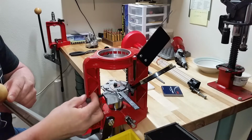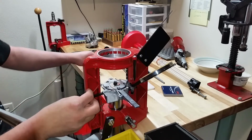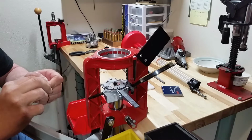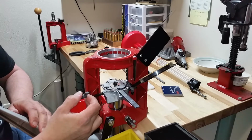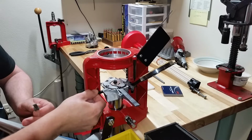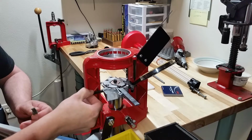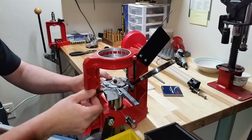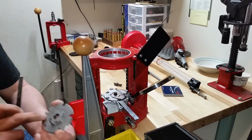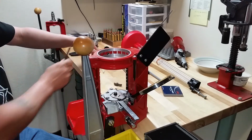When you buy these presses, you get two: a white one and a gray one. The gray one seems to be looser when it's out farther, so you screw it in farther, which keeps this from going in as far. The farther you're in on the threads, the closer or farther out the ram is. With the new plate, it's tighter. I don't know if these things are worn in more on the 9mm, but it has to be pushed in farther to stay tight.